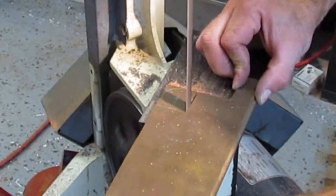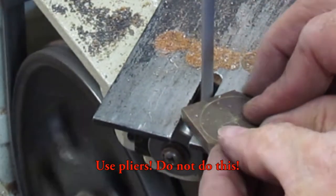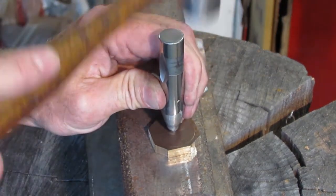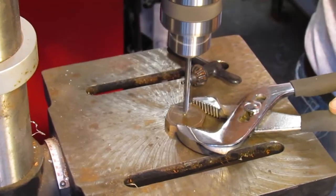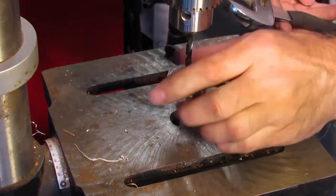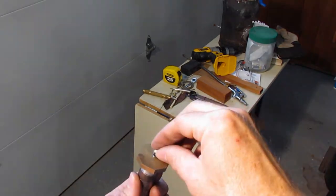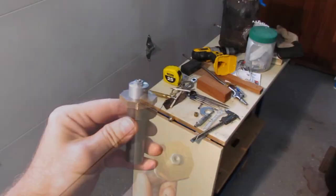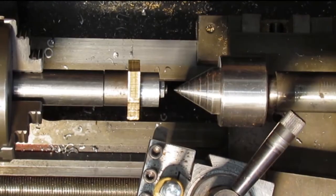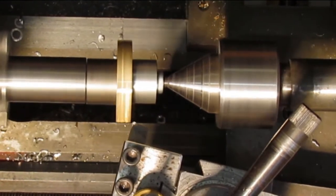The next step is to cut off the scribed part. I made a point of sawing off all the corners to reduce the amount of material the lathe has to remove. For safety I should have used pliers to hold the material in the saw. An automatic center punch doesn't punch very deep, so I used a punch and hammer to make the point deeper and easier for a drill bit to pick up on. The center point is drilled through with a 3/16ths drill bit, allowing about 10 thousandths of an inch to be removed later in the lathe. I have a mandrel with a threaded end that fits the 3/16ths hole. Using a few spacers from scrap, the crank web was fitted to the mandrel between two spacers. Tighten the nut and ready for the lathe. The mandrel is placed in the lathe chuck along with the live center in the tailstock, feeding in the tool bit and taking measurements along the way — it doesn't take long to reach the 28mm diameter.